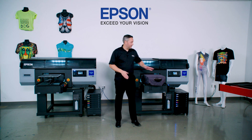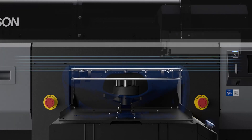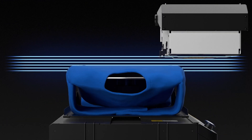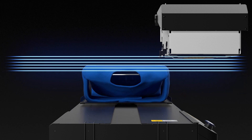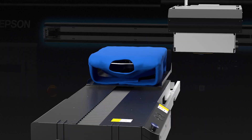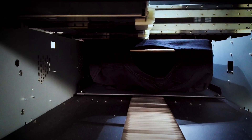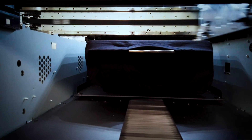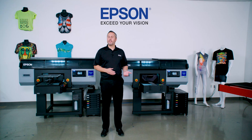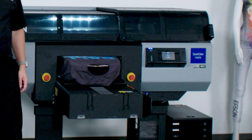Now that my sweatshirt garment is loaded on here and ready to go, when I press the start button, there are six laser beams on this system measuring the garment height. It creates a profile map of that garment, knowing where the high points are — like a collar — and where the flat spots are. By doing that, the print carriage — not the platen, but the print carriage where the head is moving — automatically moves up and down to the perfect optimized height for the best print quality. With that garment thickness optimization, you get great sellable print quality without user intervention.